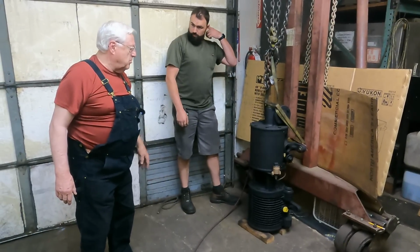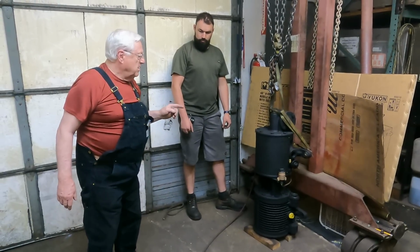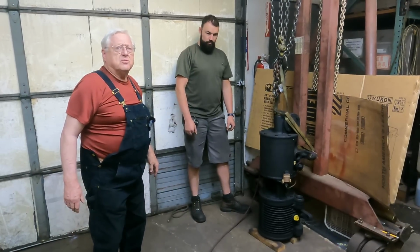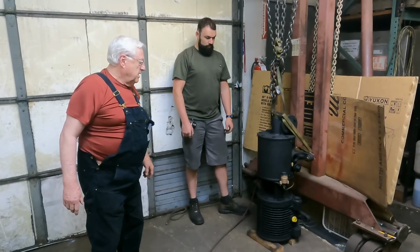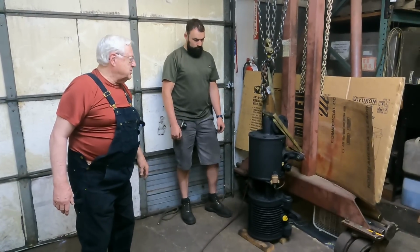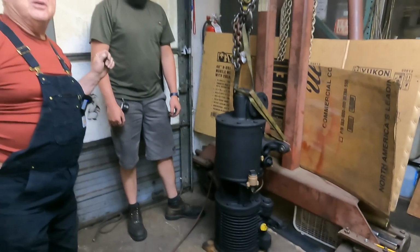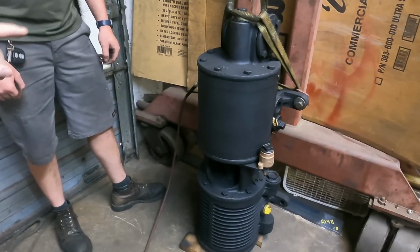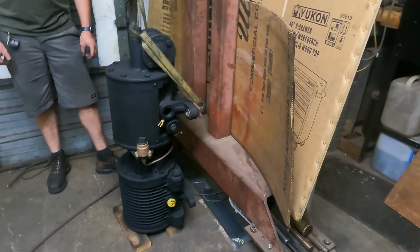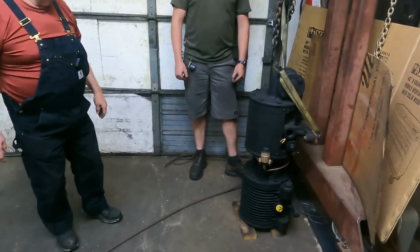So there was a reservoir or 2 reservoirs on the engine usually, and this would fill the reservoir. I've got a governor that goes with it that would automatically start and stop the compressor based on the air pressure in the reservoirs. So all the engineer had to do was watch the air gauge to make sure that everything was working right. The original ones by Westinghouse had a valve mechanism in the top head and a rope that the engineer had to use to reverse the compressor and make the thing work. But that was one of the first compressors done by Westinghouse, I think his first one was 1868. And how were brakes done before that? It was just a steam jam brake on the engine.